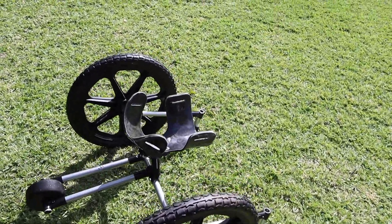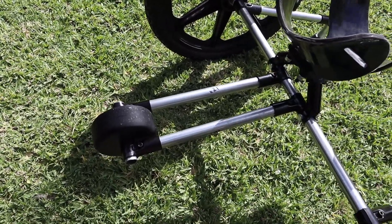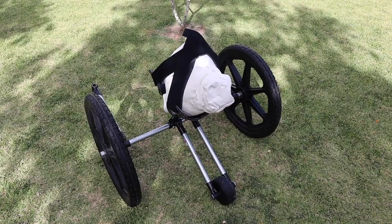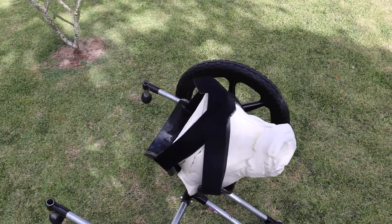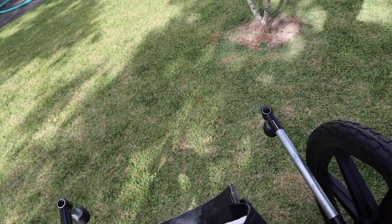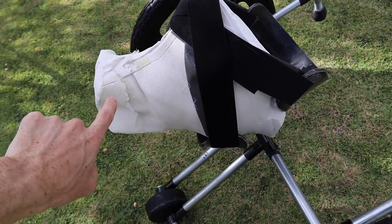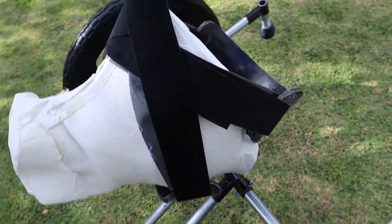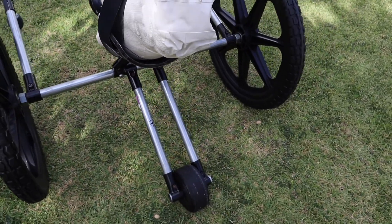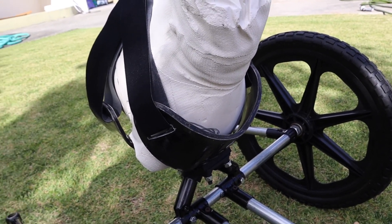The wheelchair is put together. We've got the squat stoppers installed, one on each end, and the wheel brace on the front. The only things left are the padding and the straps. With the straps done, it's completed — three straps total: two on the sides and one going over the back, all oriented to latch onto each other, very secure. You can see the cast of the sheep formed the initial main harness. Oriented properly, there's room for each leg on each side. The tip stopper is currently holding it up, but in reality it will hover above the ground and the sheep will sit squarer in the harness.